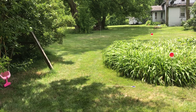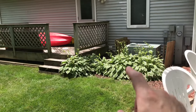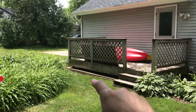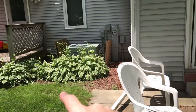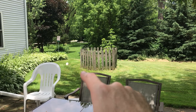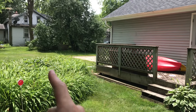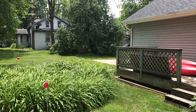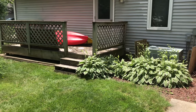I might even have to truck some out depending on how this goes. But the thing I wanted to talk to you about is overall the utilities right here. So, dedicated wash bay right here, I'm trying to figure out if the drain is going to go underneath the patio here and then over to the septic system, or can I route the drain back out this way? I'm not sure they're gonna let me do that with the water flowing back towards our neighbor's property over there. But that's one consideration I have to think about.